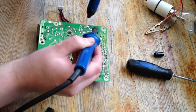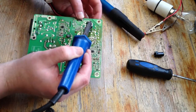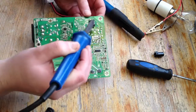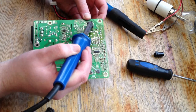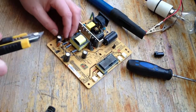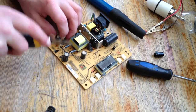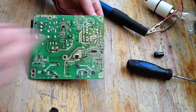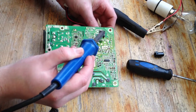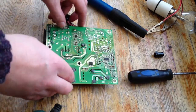Now onto the second one. I'm not bothering to feed fresh solder here — you can normally tell by looking at the solder whether it's going to melt easily. This is a reasonably fresh board so the solder is easy to remove. What you'll notice when I flip it back over is that even though I've cleared the solder, it's still holding in position. They glue the capacitor to the board. So just cut the glue between the capacitor and the board — you don't need to worry about damaging the capacitor since it's already damaged. Desolder the leads and pull it out from the other side. Take your time and it's easy enough.